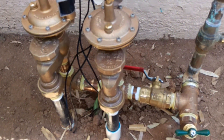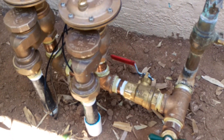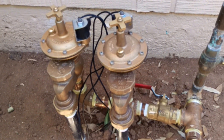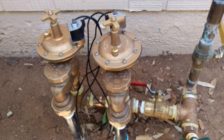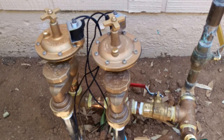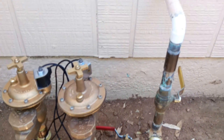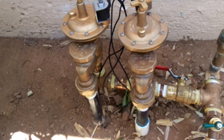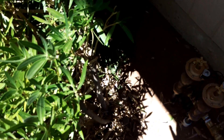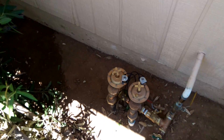Just wanted to show you this if you need a very simple irrigation design. They did a lot of these in the older part of Sun City, so we stuck with the same design. It's actually a little bit less labor than tearing it all apart and putting in a pressure vacuum breaker and then digging a valve box in. And this is a very tight area where this was all put in, so we just stuck with the same design.